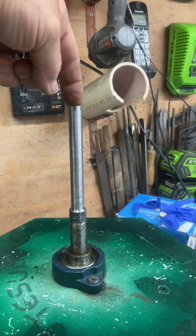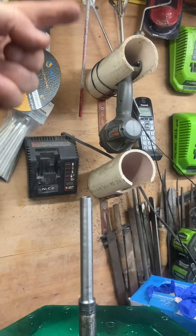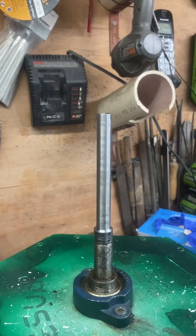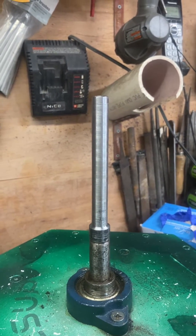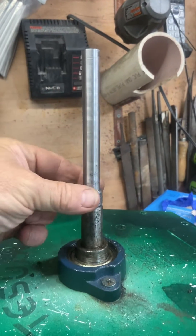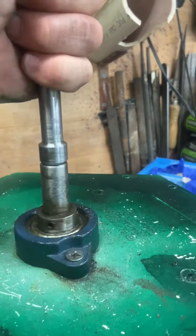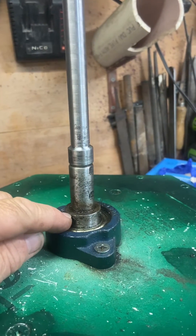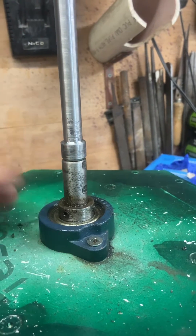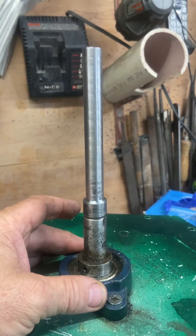Hopefully that works, and when I bring the quarter-inch rod down to the center, I'll lock-tight that in there with the red lock-tight, and then basically have the threaded rod go all the way up the tower to the top. I'll have a little centering bushing up there to put the threaded rod through and then pull it tight, so when the turbine gets pulled down on here it will sit on this — which is the rotating part of the bearing.